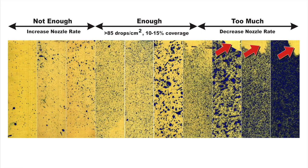You can even see shadows when obstructions prevent spray from hitting the paper. If environmental conditions change or the crop grows, you should only calibrate in conditions you'd normally spray in. You can adjust your flow by 10% or so using pressure, but if the crop really fills in or the weather changes significantly, you might have to recalibrate.